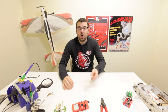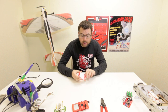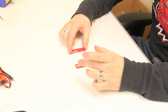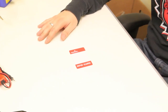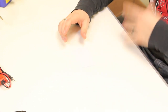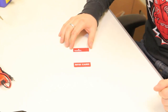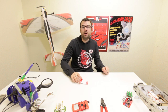We've also got a new RFID card. We've been out of stock on these for a while and this is why — we just got these in and these are SparkFun branded RFID tags. These work with the 125 kilohertz RFID readers that we carry, mainly the ID2, the ID12, and the ID20. They do not work with the Mifare stuff, but these are really neat and handy. They've got a clear sight on the back so you can write on them, and they've got a good area right here that you can write on or put stickers on. So we've got these back in stock — if you're looking for just a basic RFID card, check these out.